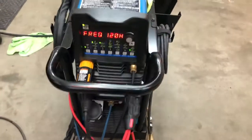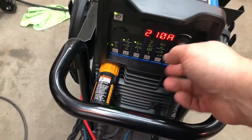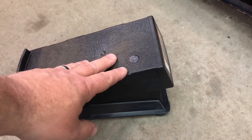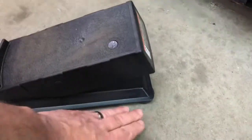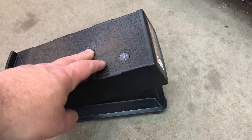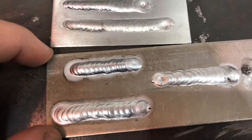What I'm going to tell you is, a lot of people say leave the machine on max, which is fine. I'm on 140 and could go up to 210. But what I like to do is give myself a maximum, because when you use the pedal, you're on zero to 210 for amps. When you hit the trigger and go all the way down, that's 210. When you sit it on 140 and hit it all the way down, it's now 140. So you get a wider range as you're going down - more incremental pedal depression to get where you need to be. What was happening is I was pushing the pedal down to where I needed it, but I think the pedal was so touchy that it was really tough to get my welds correct.